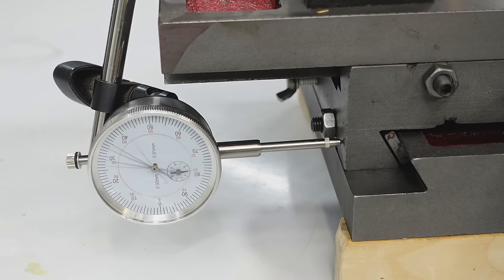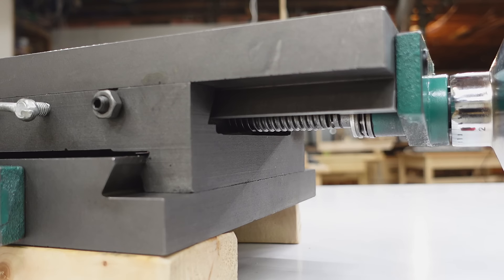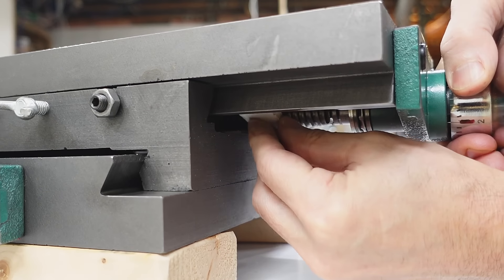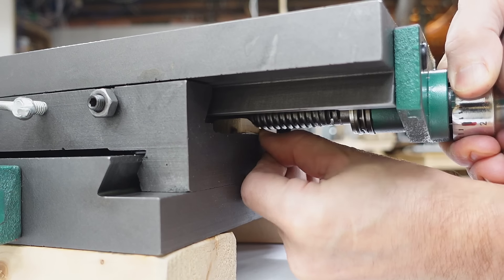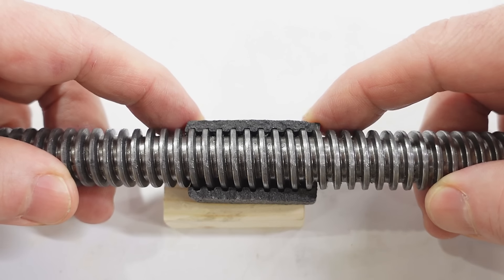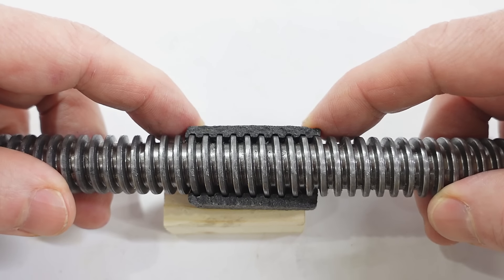Not perfect for machinists, but good enough for me. And with the jibs really loosened, I can lift up the top of the table a bit and slide in a spacer in front of that lead screw nut to lift that lead screw up a bit, so that I know at least the threads will fully engage the nut at the top side. Otherwise it's just wearing out the tips of the threads, and that's no good.